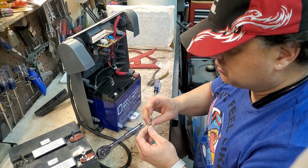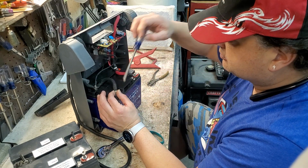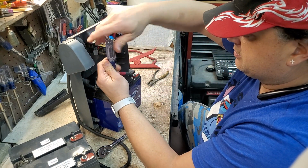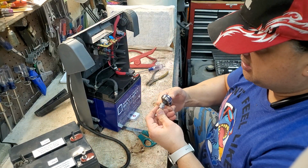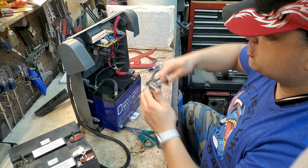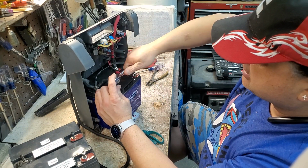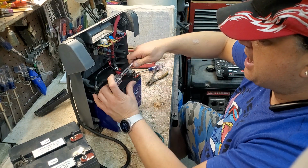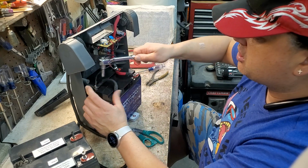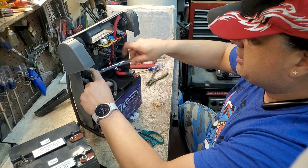Now I'm going to put the last little jumper on for the second battery. All right. Now we'll give these a little snuggy snug. Make sure you don't contact over here, so I put my knuckles over it. That way, just in case anything happens, and I drop it like this or something, it doesn't short the battery out, because that's a good way to see a big spark and potentially short out your battery internally. It's not good. Definitely don't want to be doing that.